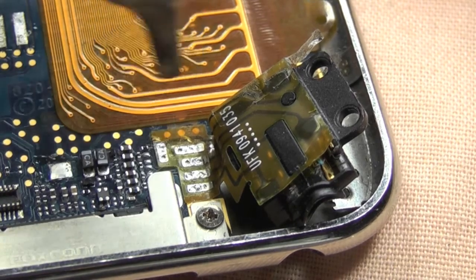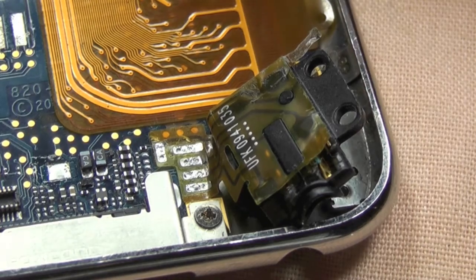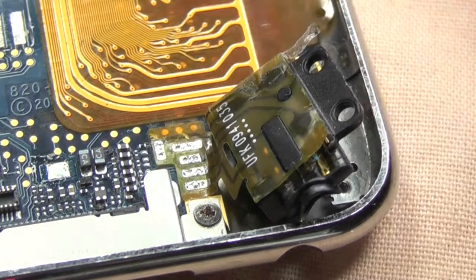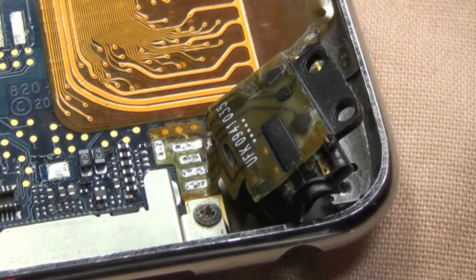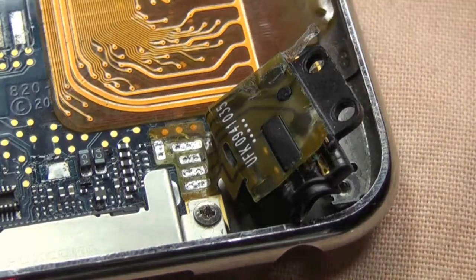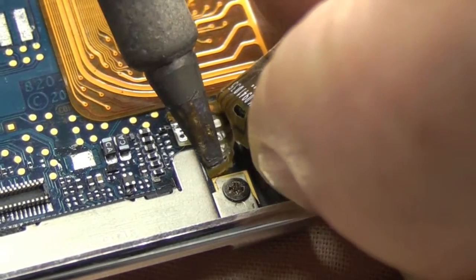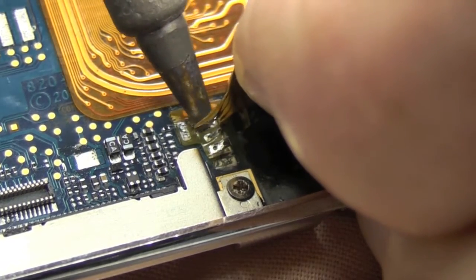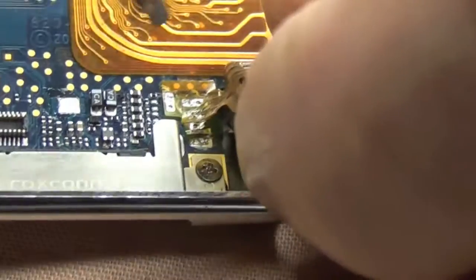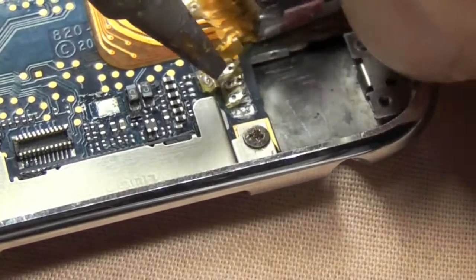You can see the holes in the pad, the ribbon cable there - that's where the excess solder will fall through if you don't remove it. You can use desolder braid or a desolder pump. I'm going to use the Weller soldering iron now with a two millimeter tip. I've got the heat ramped up to 350 degrees and we're just going in and out. I'm not pulling hard, just gentle enough pressure to allow the solder iron to do the work and melt the solder, because we want to leave these pads on the board.